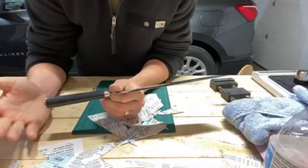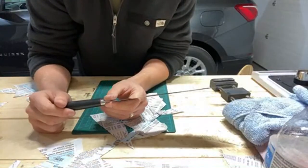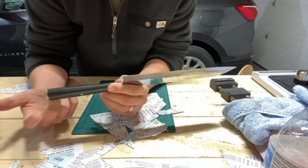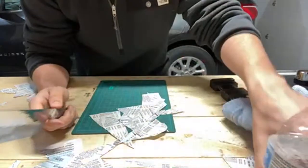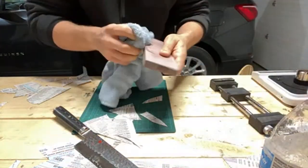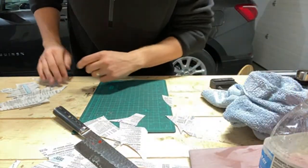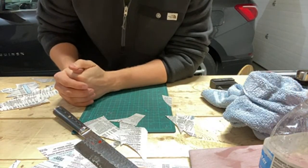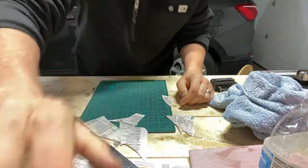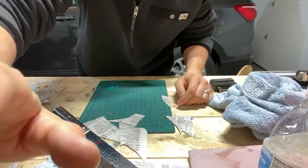So Chef Knives to Go lists it as 65 because they don't believe that it's actually at 67, 68. I did message Big Brown Bear Sean just to ask him because he's got the Sukanari, and Sean would definitely know, but I can tell the hardness of things when I sharpen on the Chocera because I'm pretty dialed in on them. So I think you would know pretty quick the difference between 65 and 68 Rockwell on HAP40 just by sharpening on something you're familiar with.